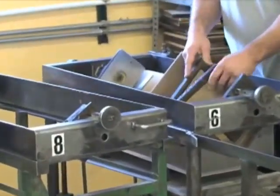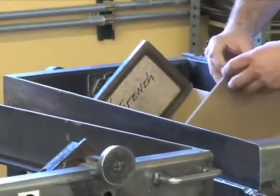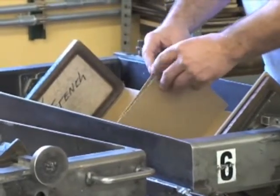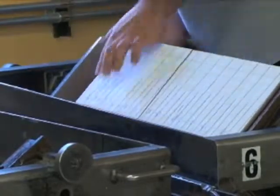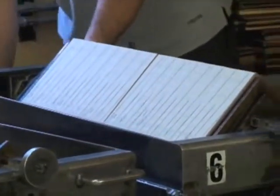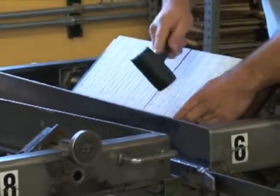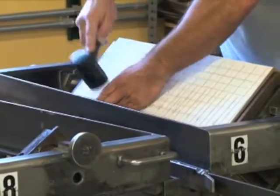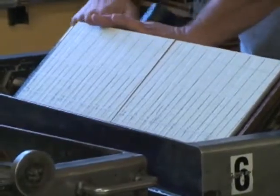Now the Bibles are moved to the clamping area, where we clamp down the Bibles we have just trimmed so that we can sand the edges extremely smooth. We have trimmed the rough printer edges off, but that doesn't give the Bible the finished look we need before we apply the gold. Depending on which style of Bible we are doing, we can fit anywhere from 16 to 23 Bibles in one clamp. The clamp is squared up using a block of wood and a mallet, tapping the top and bottom edges to get it as square as possible, so we start as straight and true as we can to make sanding easier.